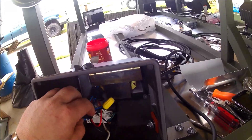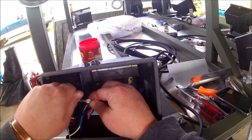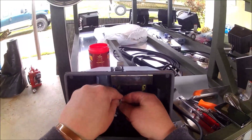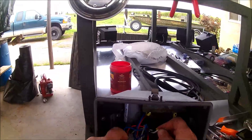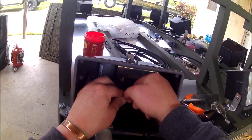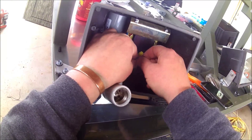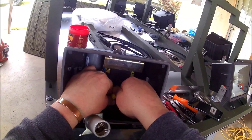You can do the same thing for the white wire. Here's your white power leg that you're going to remove and upgrade to our new wiring - that nut was barely hanging on. Toss that one to the side. Grab the other blue wire from the capacitor, wrap that around there, and then also your new white power wire. Give that a twist and get it started. These wire nuts don't seem like much, but I ran these exact lights for two years without anything coming loose inside here.